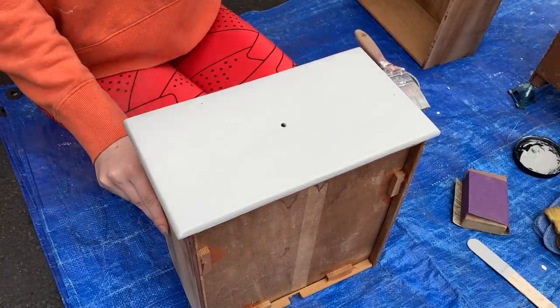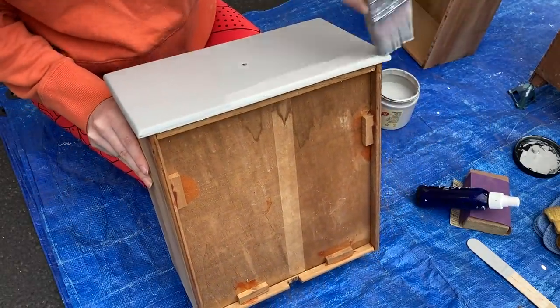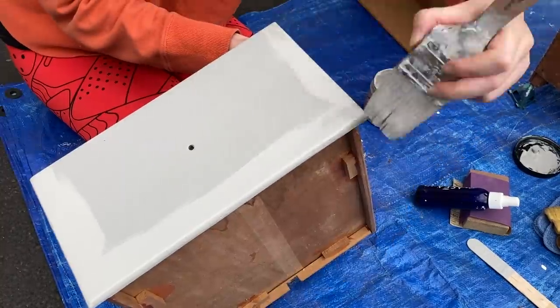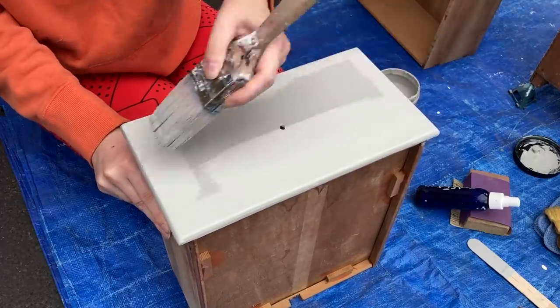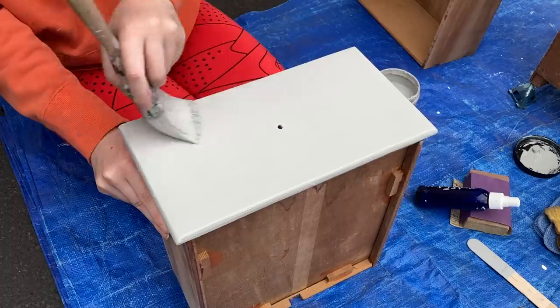For this drawer here, I was feeling like the brush was dragging a little bit, so I'm actually spraying the piece itself before coming in with that second coat. This is another way you can prevent brush strokes — it's a little bit easier than watering down the paint or spraying your brush. It just helps it go on a little bit smoother when you have that water to work over.